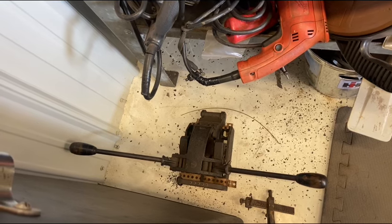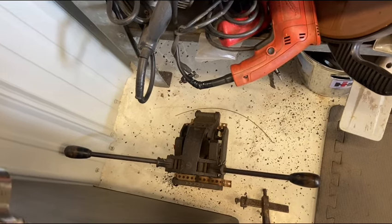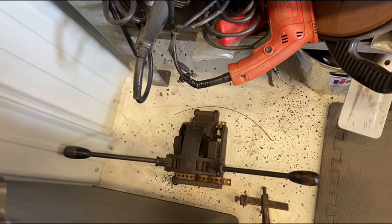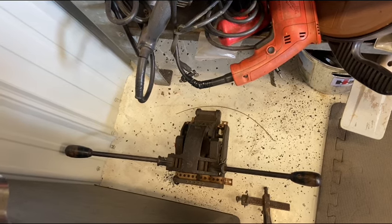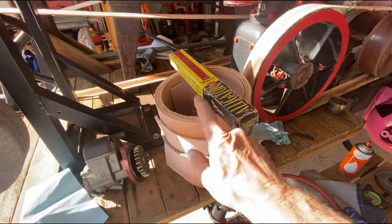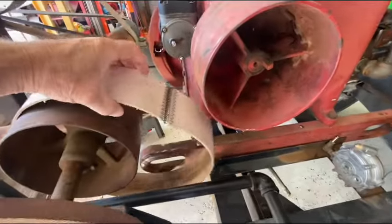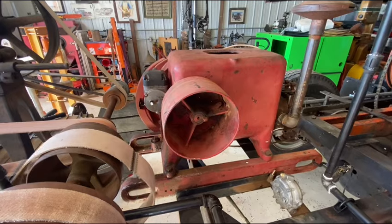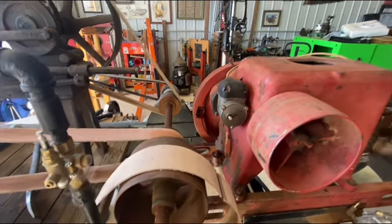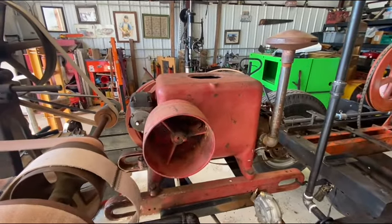This Clipper belt lacer, which I featured in previous videos when we belted the grinder on the pump jack trailer, is here on long-term loan from my pal Jim. He graciously gave me belting and alligator clips because I have to lengthen this belt. I've got this motor moved farther aft to clear the knuckle-busting pulley on the jackshaft so I can crank the flywheel over to start this engine.